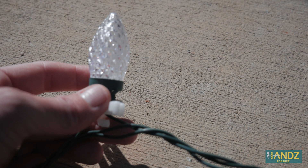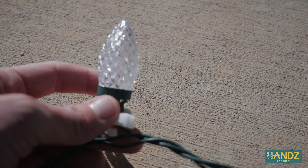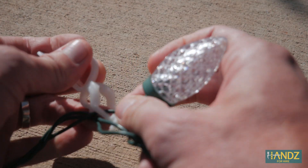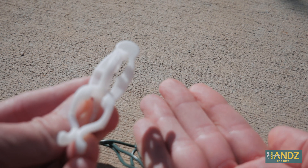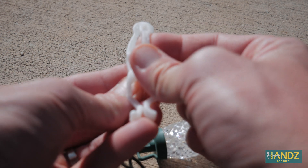Some of them are very stubborn — it's really hard to get them in the shingle itself, and the clip will break if you push too hard. So for a really stubborn spot, you may have to get the clip in first. We use a spatula sometimes — just take the spatula and go a little bit under the shingle, and then this slides right in.